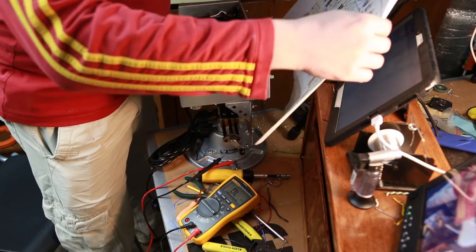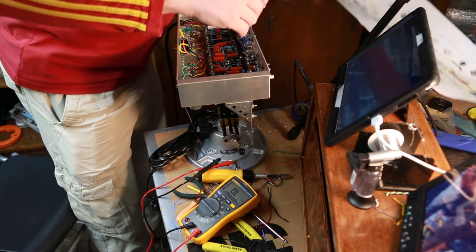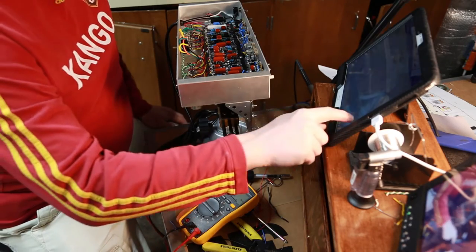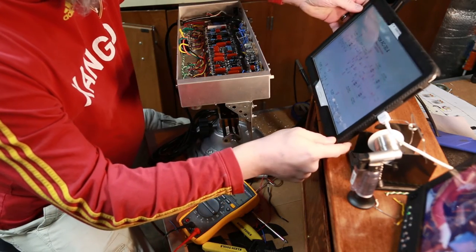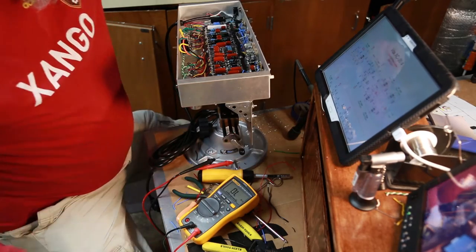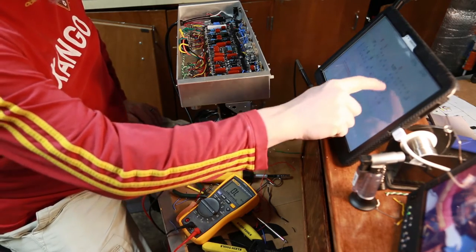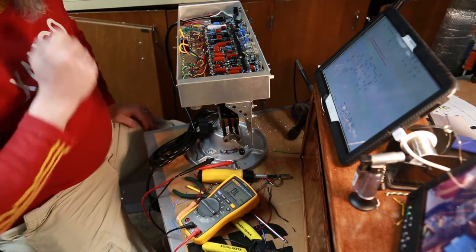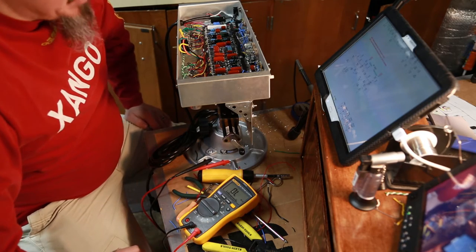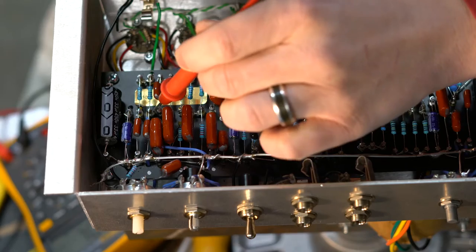Oh, that's gonna be tricky — I need to find a place to set this. I'll set it aside because I don't know that I'll need to grab it all the time when I've got the schematic in front of me. The schematic is here; I don't know if that's super visible to you, but it's there. So I'll be able to look at what I'm looking at and then go from there. For example, right now the footswitch connection comes down off of a 1 meg resistor, so I'll be checking that — it should be this one right here.